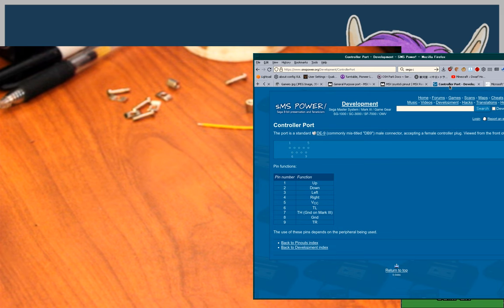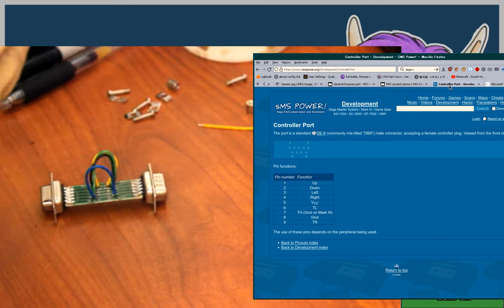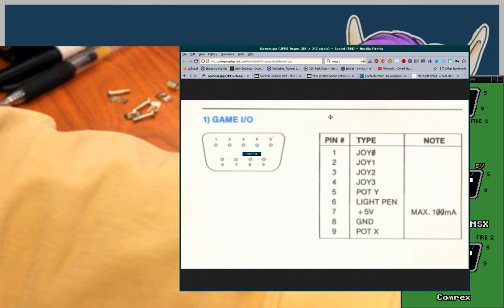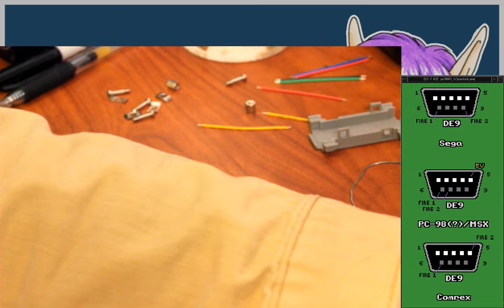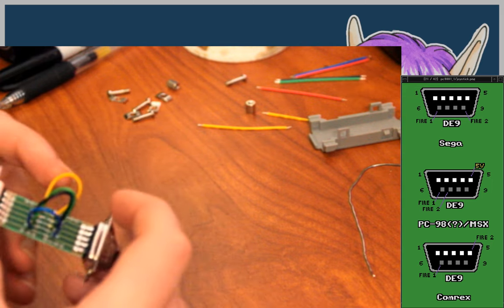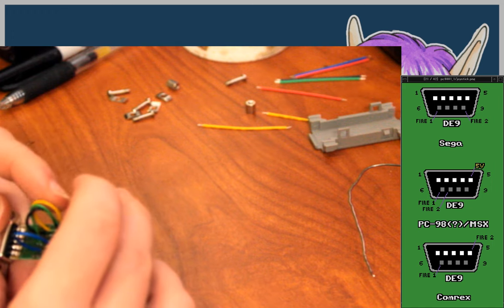Okay, so I think besides the 5 volts and ground, and what is... I'm still a little concerned because... What is the actual original Atari pinout? Just really fast. Yeah, so pin 8 being ground. I'm pretty sure this is from the Commodore VIC-20 programmer's manual, because I just found this picture online earlier today randomly, but I have a physical copy of the VIC-20 programmer's manual somewhere, and this just looks very familiar. Like the blue color for the header, the table shape. If it's not the VIC-20, I bet it's another Commodore product. And Commodore definitely used the Atari joystick adapter pinout.